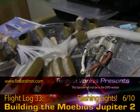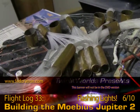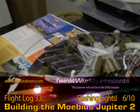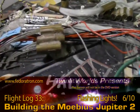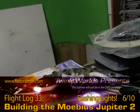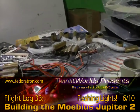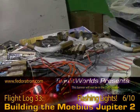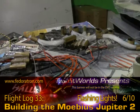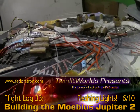If I wanted to recut all of this I really don't, and I don't think there's a need to either — the overall look is still going to work very well. Next up, I don't have to put resistors on these LEDs because that's already taken care of by the sequencer. All I have to do is wire these up and plug them into place. I'll be running multiple LEDs off of each wire, with different things blinking at different times all across the ship. I want as much variety on the blinking as possible — if two speeds are close they'll fall out of sequence after a while, and that'll help with variety.